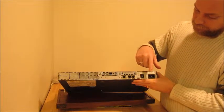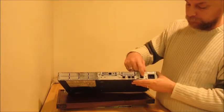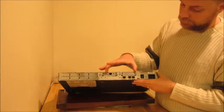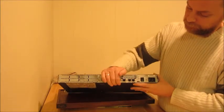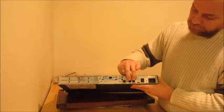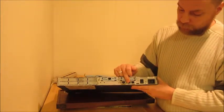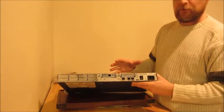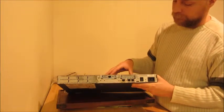Next we've got the power socket and also the power switch over here — very convenient. This area here is where we're seeing the ports, and this is probably the most important thing to us at this point. These two ports here are for administration of the device. One here is labeled in light blue and that's the console port — that's a serial connection that we can connect to a computer and use to directly configure this device.